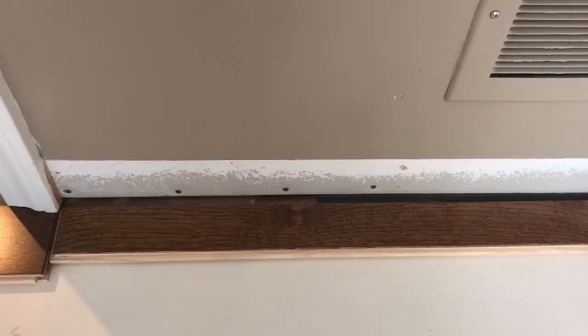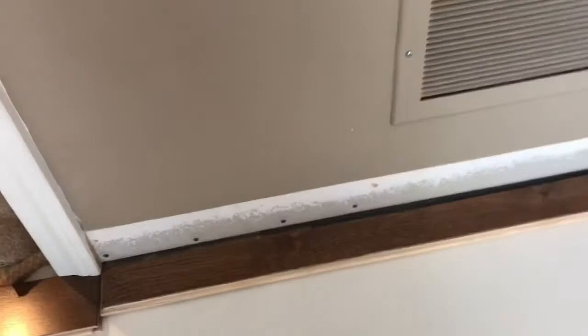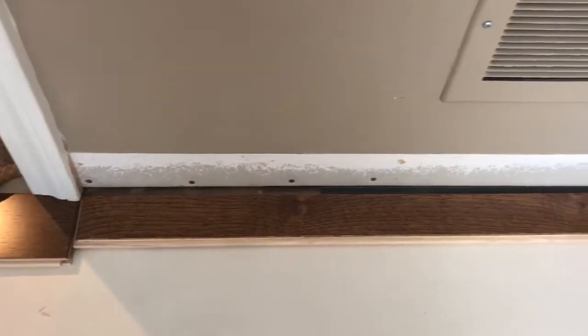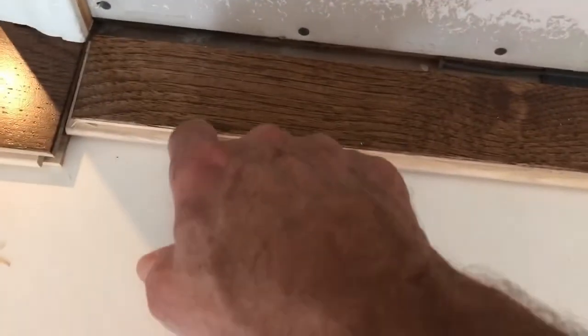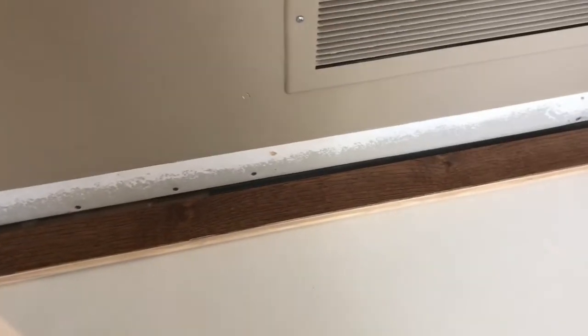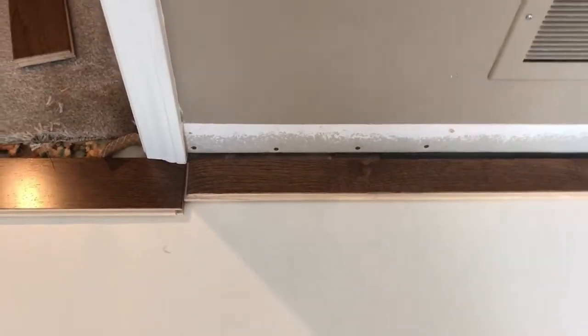But I'm going to start with a 1/2 inch gap from the wall, plus the 1/2 inch of the drywall. So I'll have an inch gap technically on this starting row. So we'll do some nails on the edge, and then I'll pre-drill, just like a nail gun would, at an angle, so that both sides of the wood are down.